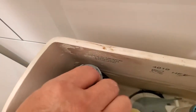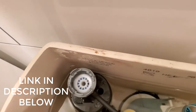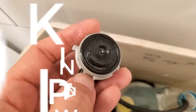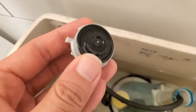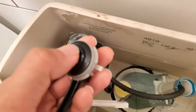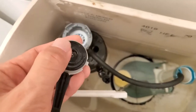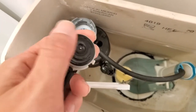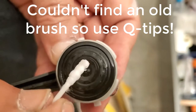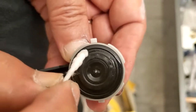The reason it's making that running sound is this rubber valve — you can see a little bit of deposit on it right there. Take a light toothbrush and brush all of that off, then use a Q-tip to brush it clean, taking off all the debris before putting it back in.